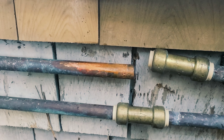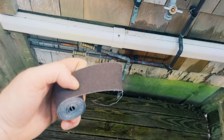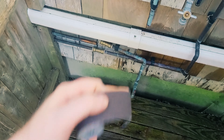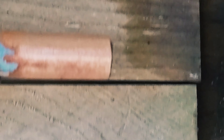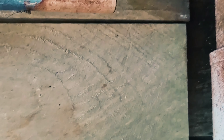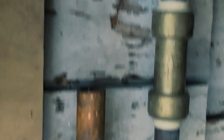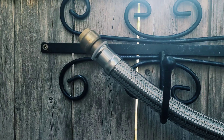So I can take this whole part off. Now I'm going to clean this with the emery paper — here and here. What you do is wrap it like a towel around the pipe, arms toward the front, towel on your back, and go all the way around. Shimmy all the way around until that's a nice, clean copper surface for the new SharkBite to slide onto. Take off about six inches of emery paper so you can use it like a towel and go all the way around from the top. You'll get all surfaces done. You want to make sure there are no burrs or things that are going to damage the teeth on the SharkBite piece when you slide it on.